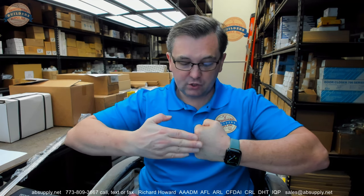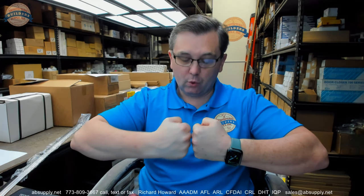The fact that there is only one astragal is not unusual. You could certainly have an active door where the inactive door is rarely opened. You're going to mount the astragal on the pull side of the active door. Or if it's an in-swing application, you could have the astragal mounted to the push side of the inactive door, so that door always seals up against the bristle. You want that astragal to be on the exterior — your line of defense as close to the outside as possible.